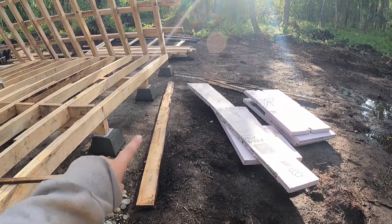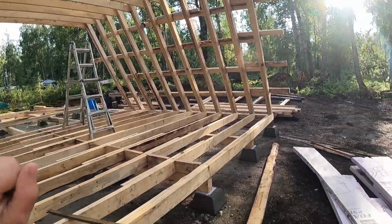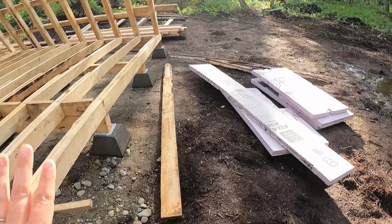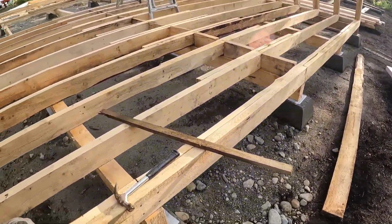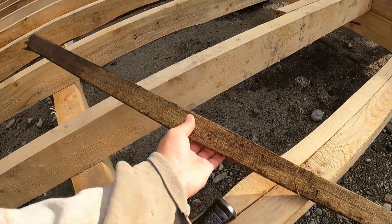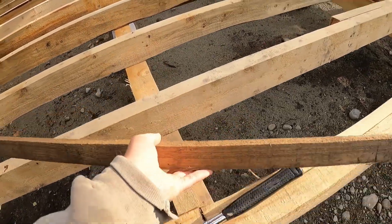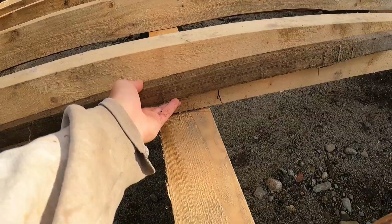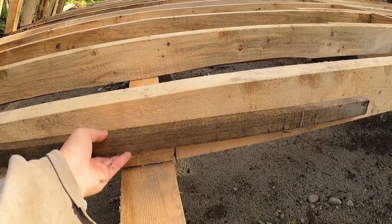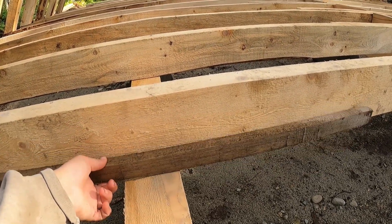And then for the floor, we have all of this stuff that we grabbed, and it's kind of piled way back there, that we got when we helped clean up a neighbor's house. And we're going to use this stuff first in the floor. But we don't want to do 3 layers thick. So we have these end cutoff boards that are about a 1x2 or something similar. And what we're going to do is we're going to kind of nail them up as a spacer so that the insulation can sit up higher and not be lower.